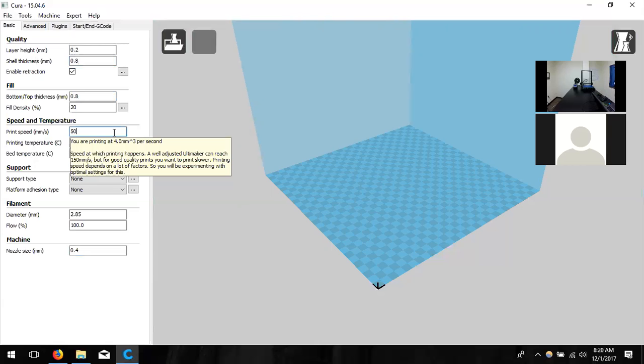Printing temperature — we're going to change this to 220 degrees Celsius. That's our typical value for any PLA, and the carbon fiber will also print at 220. The conductive should print well at 220, and the TPU can be finicky — you may have to adjust to 210. What about the wood filament? Wood filament prints well at 220. A weird thing about wood filament is the hotter it is, the darker the print looks, so you can vary the temperature between 200–230 to get a color variation in the print.